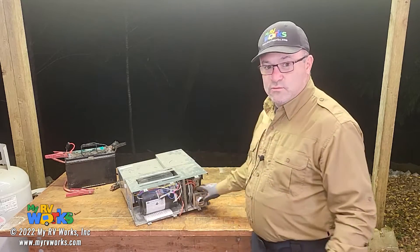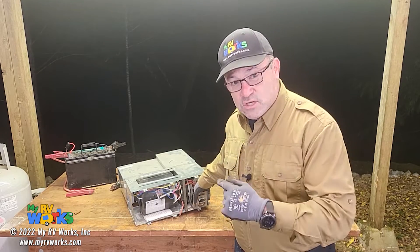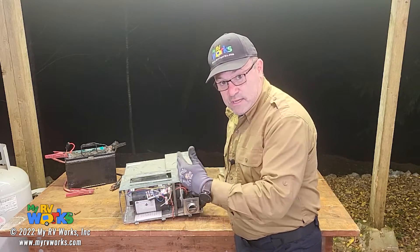Basically, Kevin, yes — when you're running your furnaces, especially these new Dometic ones, it is very much required that the exhaust port be inserted into that port. Now, this one here is not a Dometic, it's an Atwood, but the concept is the same.